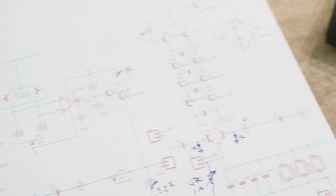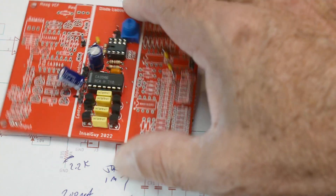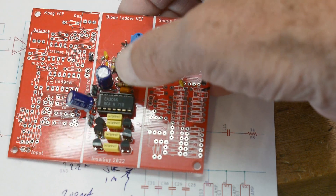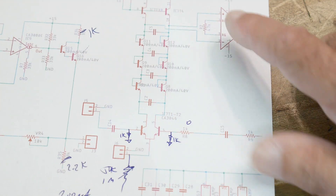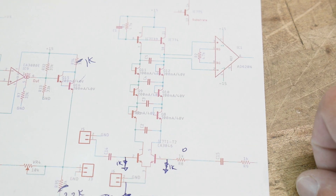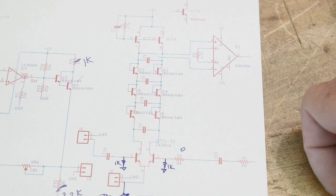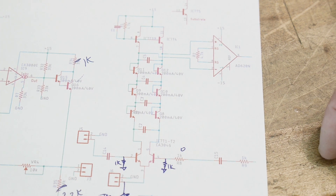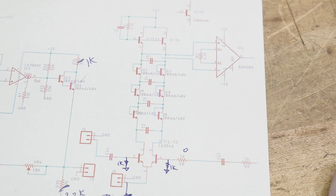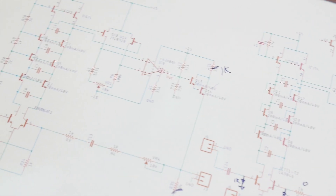The other board that I built is this circuit over here, which is the Roland filter. This section here was the Moog and this is the Roland. I do not have the right chip here yet — I have it on order, which is the instrumentation amplifier. I need an AD620. Those shouldn't take long to get here because they're being shipped from town — a surplus store called Altronics. They used to have an open store you could browse, but not anymore. So there's still some more investigation to be done to get this thing working.